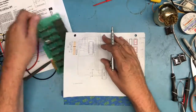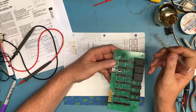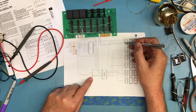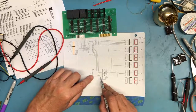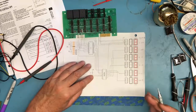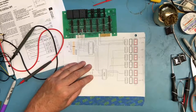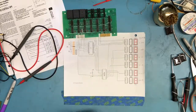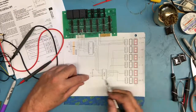That really makes sense. So that single 10K ohm resistor there is simply a pull up resistor. All the pull-up resistor does is take a floating input, such as these inputs are. All of these, the BL pins and that E pin, are inputs. And if they weren't connected to anything, they'd float, which just means there's nothing driving them. And in logic systems, floating pins can oscillate, they can react to pins around them, they can create random behavior. So essentially, you terminate them. You either tie them to ground, tie them to VCC, or the more traditional way was to use a pull-up resistor.